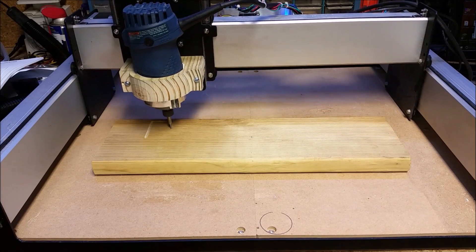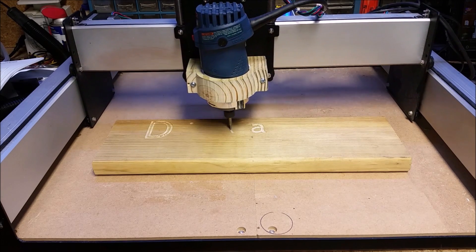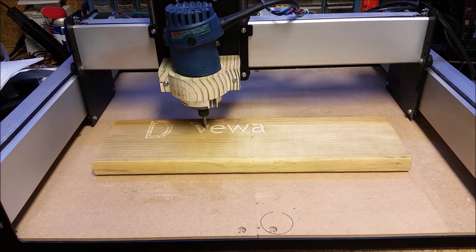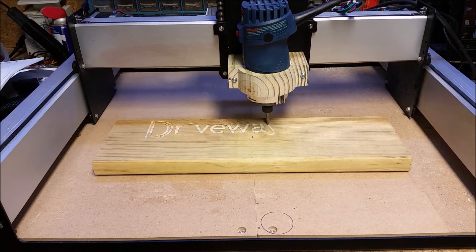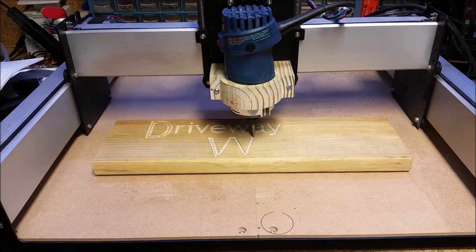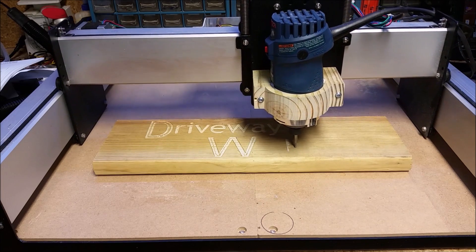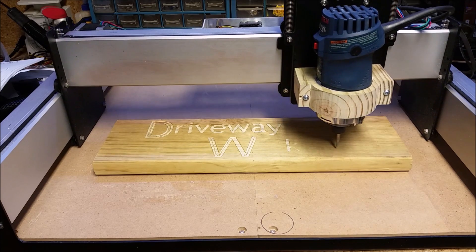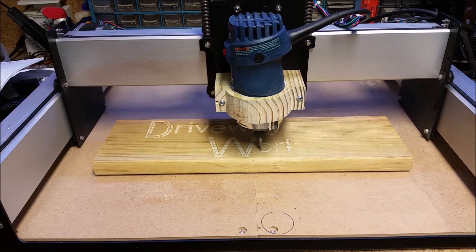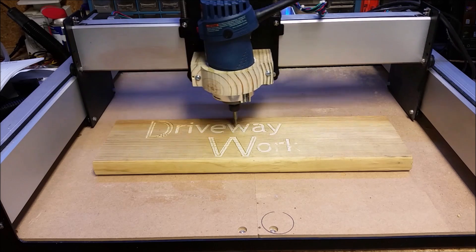Here's the first thing I cut out with the CNC — a driveway workshop sign, which is the name of my YouTube channel. I'm cutting it onto an off-cut from a deck board scrap left over from our front porch build last fall. Two mistakes I made on my first try: one was that my workpiece wasn't flat, and as you saw during the first pass it didn't cut the 'shop' in workshop — it got to it on the next pass, but everything has to be as square and as level as possible. The second was that I only generated one tool path, the G-code used to cut everything out. There was a waste strip in the D and the W because my tool path was set to cut on the left of the cutter — I needed another path to cut on the cutter line to clear all that out. I have a Bosch Colt trim router that I'll be upgrading to a DeWalt 611 for variable speed and an extra quarter horsepower. The spindle holder that comes with the Shapeoko is sized for the DeWalt, so I had to fabricate a temporary holder for my Bosch.